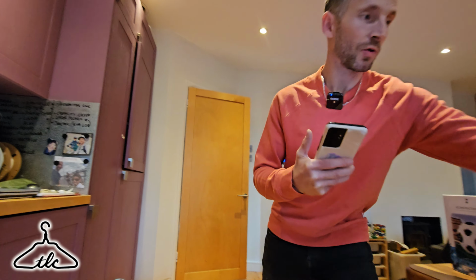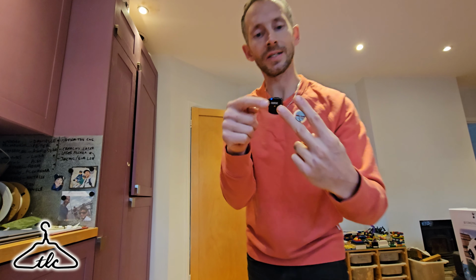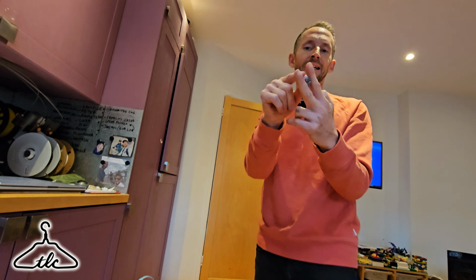The plastic collar protrudes. I talked about that too. So this is the plastic collar. This part sticks out, and it needs to be that way so it stops up against the plasterboard. Say that's your hole. It's going through the hole. You've knocked it in. It's got those little spiky bits around the edges, these bits, to stop it spinning. But once you've knocked it in, it can't spin and it can't go any further. So you're going to need those. But a mil was probably the minimum the designers thought is doable, but it's tough, durable plastic.